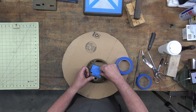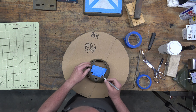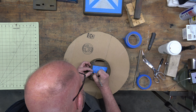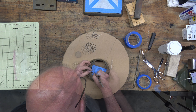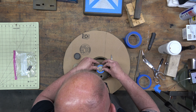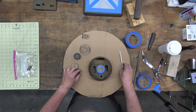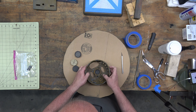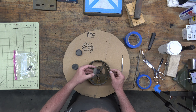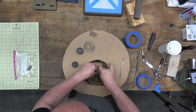This is one of the end frames for the motor — this is the terminal end. There's a milled surface where the felt covers go, so I'm just going to cut that out and then cut out the center of it. I've got some old half-inch thick foam floor mats that I cut into plugs and shove them into the bore for the bearings on each one of these end frames. That does a good job of masking that so I don't have to line it with tape. I could probably do that for the head unit as well — I just never got around to it.